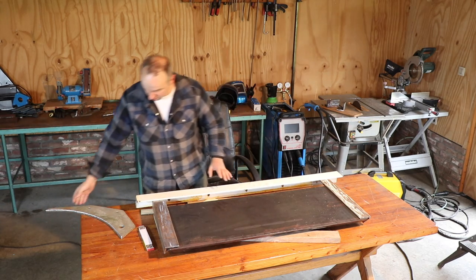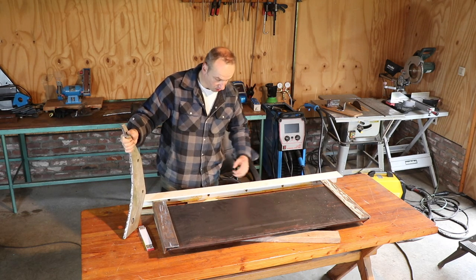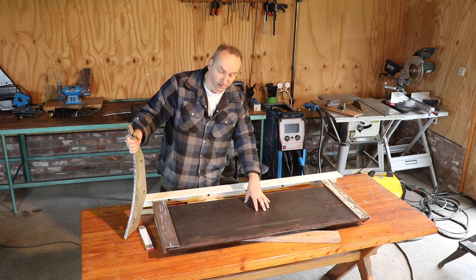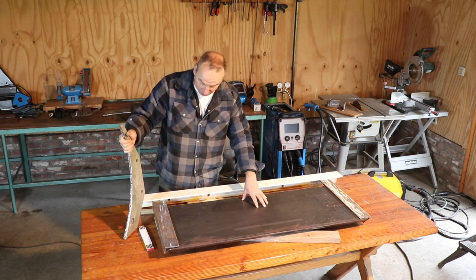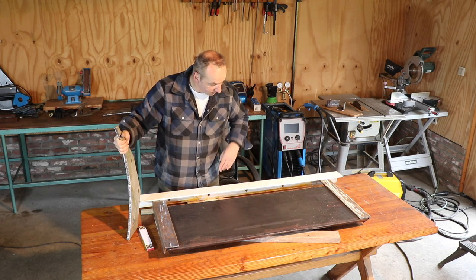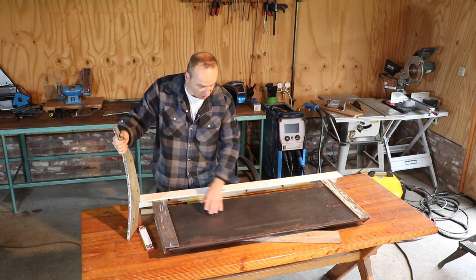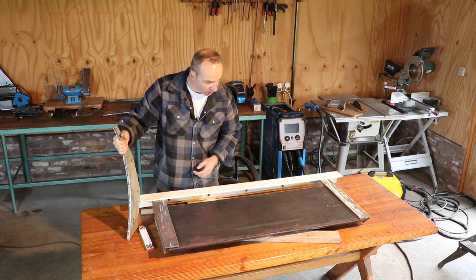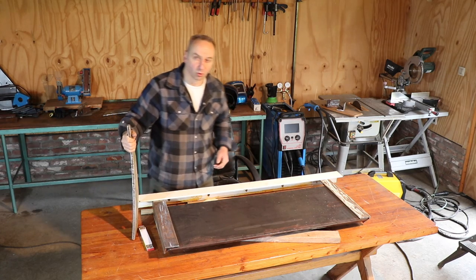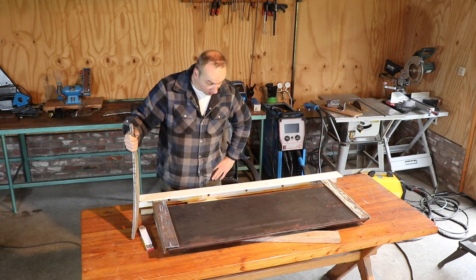Now, all of this is made from scrapyard material except the welding plate. This is a Bobcat welding plate that I bought online. As mentioned when I discussed the video on the root ripper, the Rhino ripper, I really like this welding plate. It's 6 millimeters, it's reinforced at the interfaces at the bottom. It has a very strong top, 12 millimeter ridge to have the lifting. So I really like that.